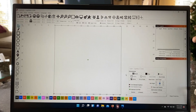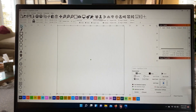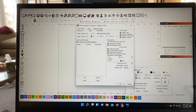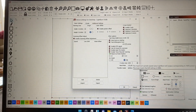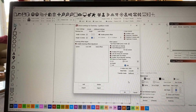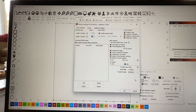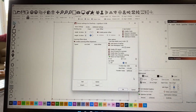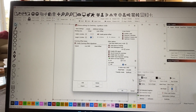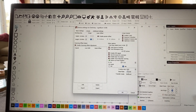Once you've got your firmware updated on your Onefinity controller, come into LightBurn and go up to Device Settings. Look in the lower right corner — you'll see S Value Max. You need to change this to 1000; typically it's sitting at 250. Basically it works like a batting average, so 250 is 25%. Bring it all the way up to 1000 and it will work correctly with your machine. If you don't do that you're going to get very inconsistent burns. I did a lot of research on this — as long as you have your firmware updated and you change this to 1000, you will have no problems at all.